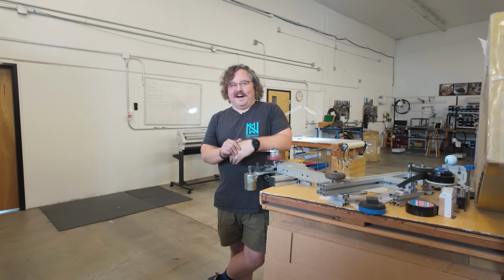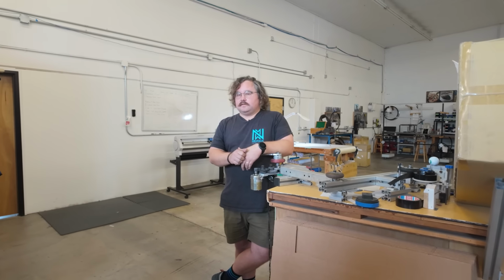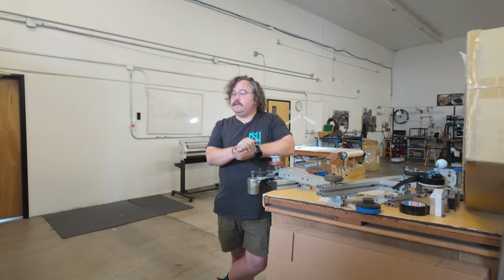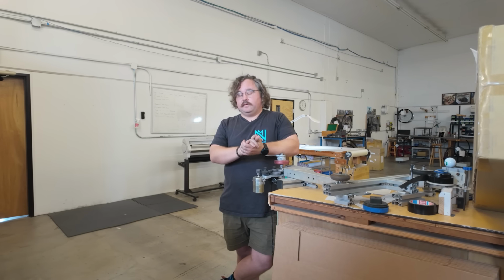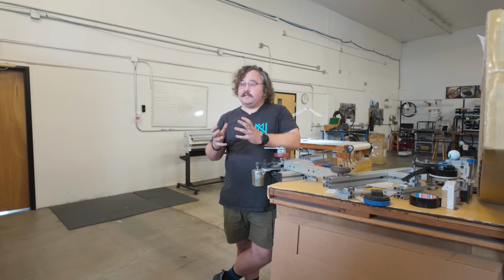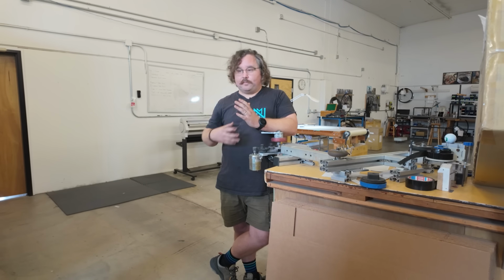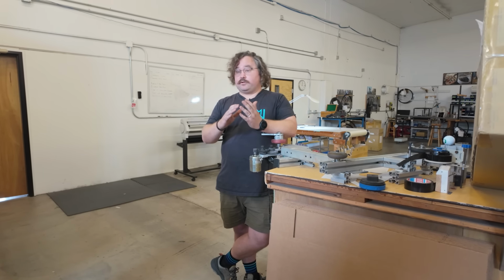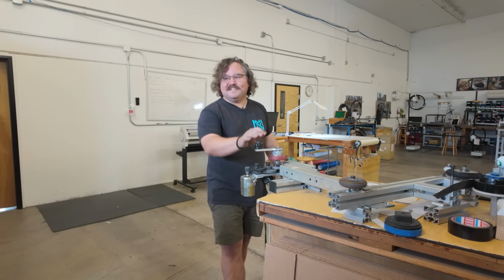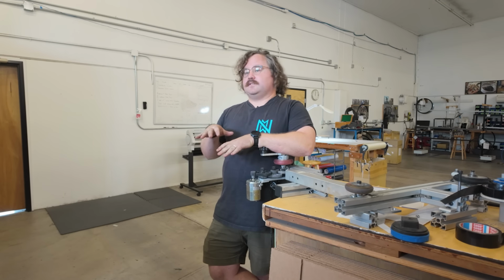Important secrets. Or something very necessary. I mean, the tensiometer is one of the most necessary things to making a really nice wheel. Having that DT Swiss tensiometer really helps us make sure that every wheel goes out extremely balanced in tension. And when you have a wheel that is starting out at a good place, super balanced tension, it is less likely to go out of true down the line. And I guess the second one would be that squishy machine. That squishy machine really makes everything, once it leaves this factory, just reliable.